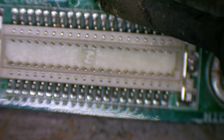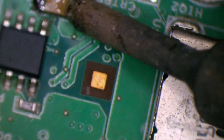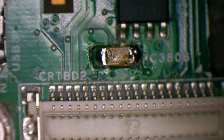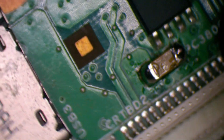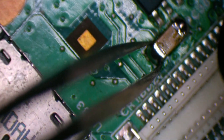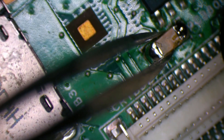If I add some normal solder to this and flood it, it has a better chance of coming off at a lower temperature. There's not a lot of thermal mass in this board anyway so it should be relatively easy to remove. I'll point the nozzle away from the plastic connector — directly at the USB port — and let's go for somewhere in the middle and just gently get that solder liquid.